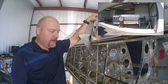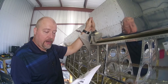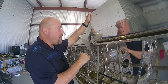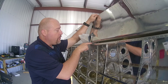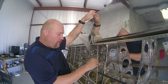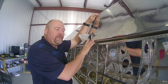While that guy's over there working on getting the tank off, I thought I would talk about this bracket again. In a previous video I talked about this service bulletin that had come out — it was to replace this entire structure because they were finding some cracking in it. I did so per their instructions and noticed some binding between this piece and a couple of these rivets down here. To alleviate that, I changed the shape of this piece a little bit because I didn't want to screw up the existing structure. There is no binding at all here now, but you never know — as things change shape slightly, maybe in the heat, that could become a problem. And that's the last thing you want is a problem on this part in flight.